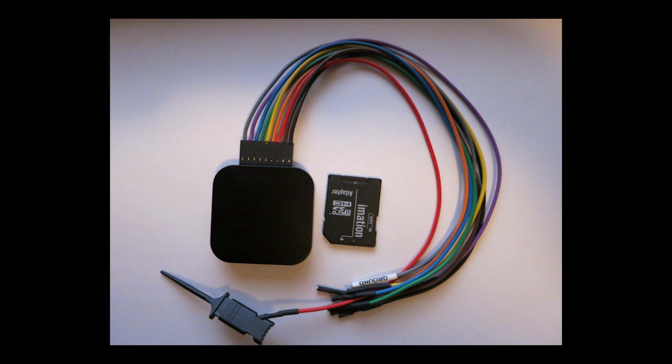The tool we used for that at first is a logic analyzer. It has some probes that you connect to the pins of the chip, and it will sample those pins many millions of times per second, 2 or 4 or 20 megahertz or up to like 100 megahertz or faster, depending on how expensive it is. And it'll record whether each of the sampled pins was a high or a low, a digital 1 or a digital 0, and it'll keep track of all of them. So you can analyze that later. You basically get this kind of square waveform. And then the software for these can decode a whole lot of protocols, including I2C, which is really good for us.